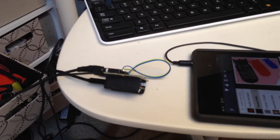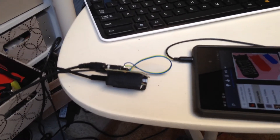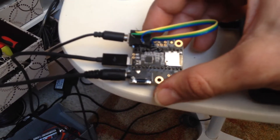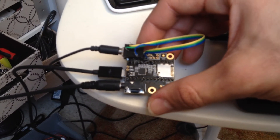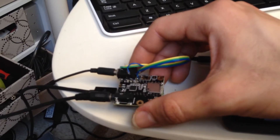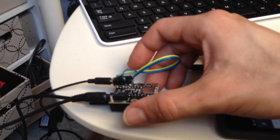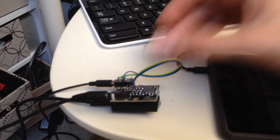Maybe that hash is some byproduct of the way the chip is clocked, or some byproduct of the way the chip is powered. It's probably not the cleanest ground plane and all that stuff, and I can expect some of that. It's mostly the quality of that noise that seems to me a bit unusual.